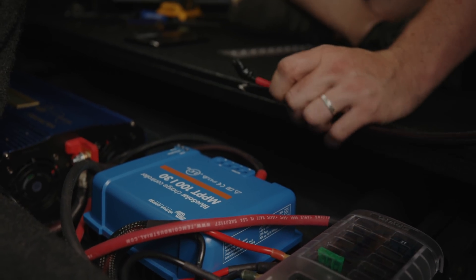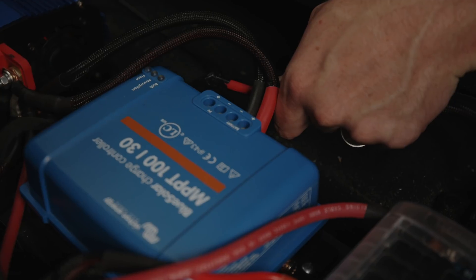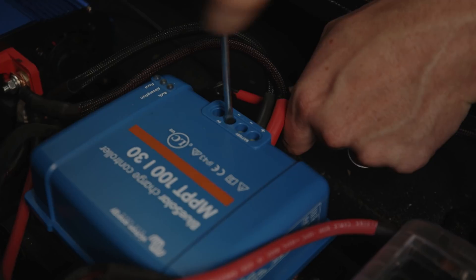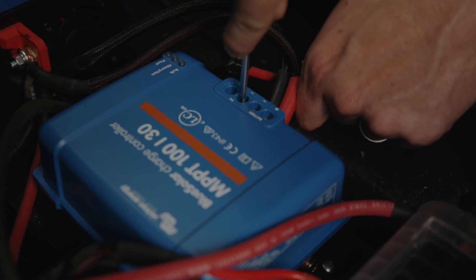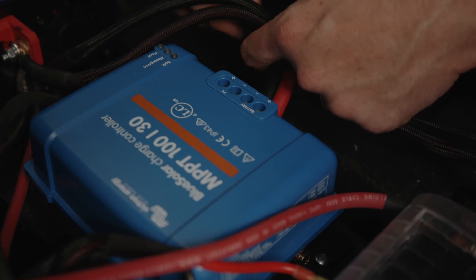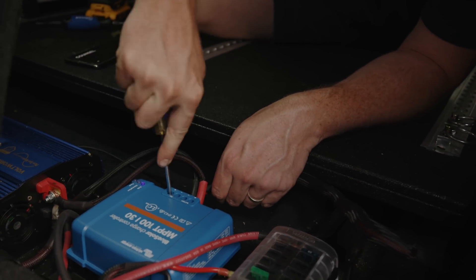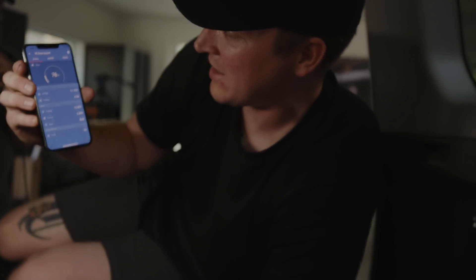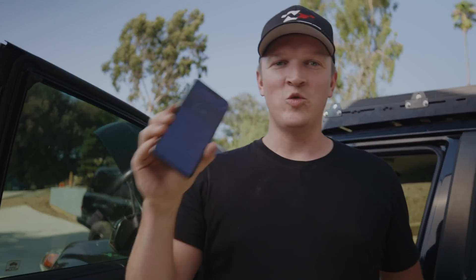We went ahead and did the Anderson plug up there, so we're going to set these in right now. Negative first. There are built-in flatheads that allow you to cinch down the exposed strands of wire — get that nice and tight. We covered up our positive just because we didn't want anything to accidentally short. And you can see the bulk light blinking — power is coming in! We have incoming voltage of 17.18 volts, 76 watts actually coming in right now live. We're going to pull this out into the driveway where we have more direct sunlight. We pulled it out into the driveway and this thing works incredibly — tracking it right now with our Bluetooth app, and it looks like we're close to 200 watts of input power.